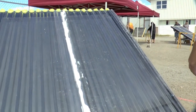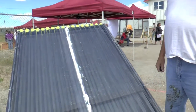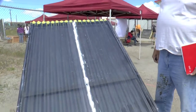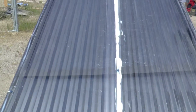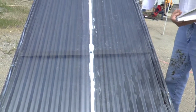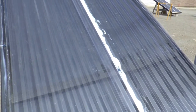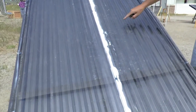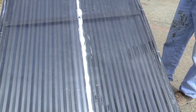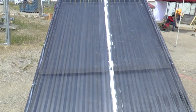Crinkle it up a little bit in places, just to see if the effect would be — it would increase, get the air, cause turbulence inside. Yeah, that's what we did, and make the air suck up more heat. Put down some flat ones first, about three layers. Then we staple them in and then we get some more, kind of fold them over about four times — we got four of them in here, then we crinkle them up. Just the foil. Then we painted it black. The screens are double, on both sides — there's a screen on this side and there's a screen on the back side.